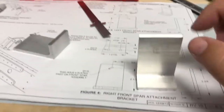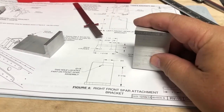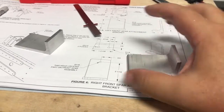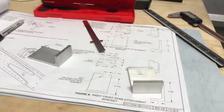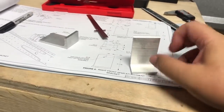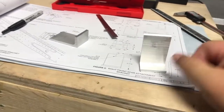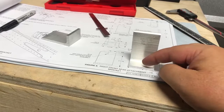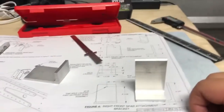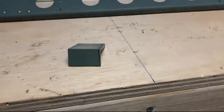Instead of cutting this, when I do the deburring process, I can take off that little bit using the deburring. So pretty close, but that's just to help you guys understand. When I say precision part, what's more important is where these holes go. Dimensionally a little bit wider is not going to cause any major issues. It's where these holes go. And like I said, we are definitely there within government work. So there you go. Just want to share that with you.